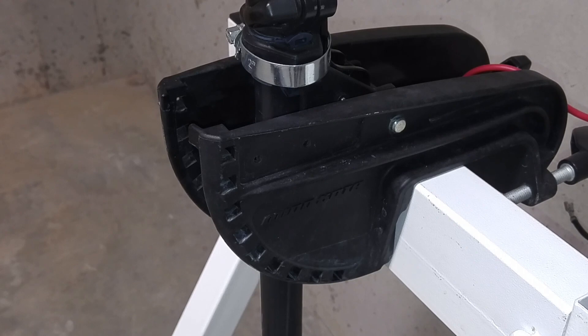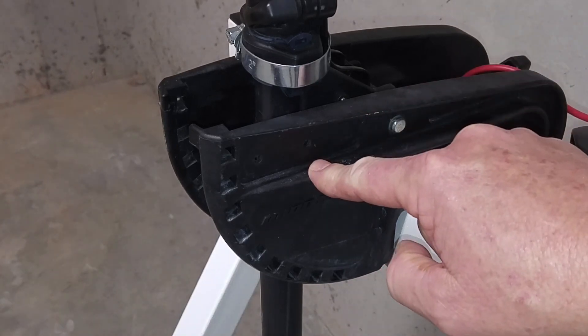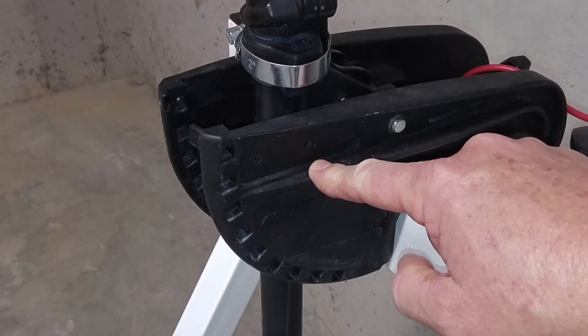For the lift system, I had to make a template for the Harken pulley. As you can see, I have two holes drilled here. Because of where I chose it, there's plenty of space to put the bolt head back there. The spacer is to bring it out away from the side of the trolling motor bracket so the cable will be free to go through. The second part of the pulley lift system is you have to drill a hole in the front gusset of the trolling motor, and that's where you're going to connect your pulley using the quick link.